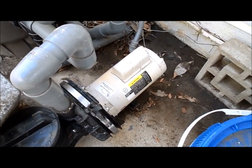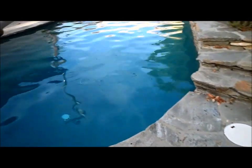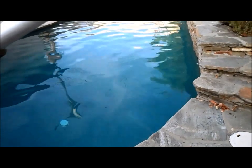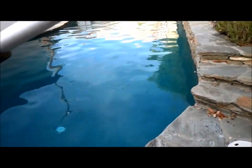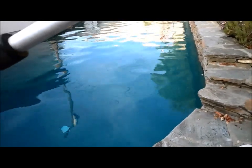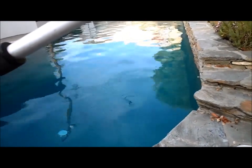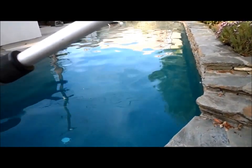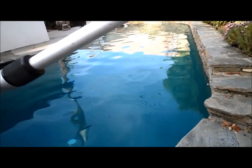This one also has really bad bearings. So those are two examples of a motor that has bad bearings that needs to be rebuilt. You can still hear this one in the background — I'm only about 20 feet from it and it's pretty loud. I can actually hear it from the street. Call a pool service guy out here to rebuild the motor for you, and that will give you a couple more years of life out of it.